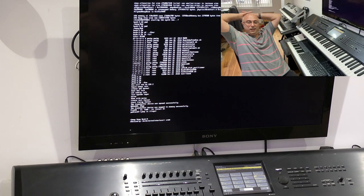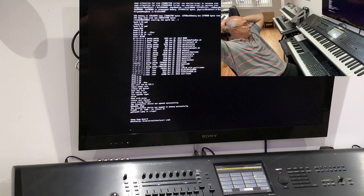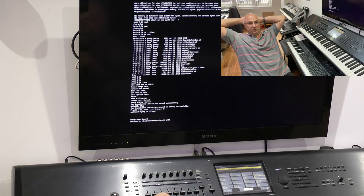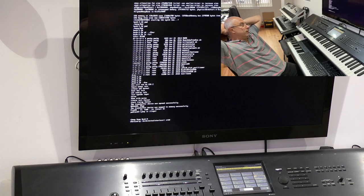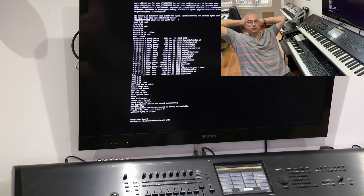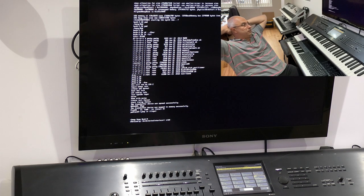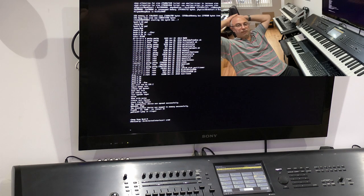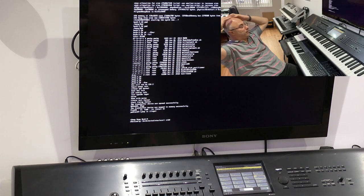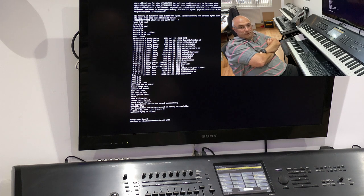But have you guessed it yet? Probably not. Notice the procedure we loaded the system with. When you first run the system, it runs something called loadOA.ko, and loadOA does all that stuff in the background that we just did. It checks the BIOS, it checks the OS, it mounts the thing and decrypts the file system, mounts it all up, does the loop setup, loads up all the modules, and then loads up EVA eventually.